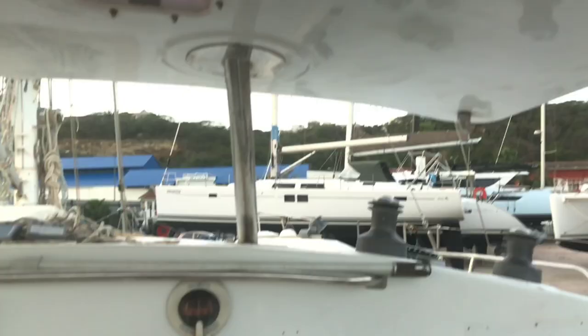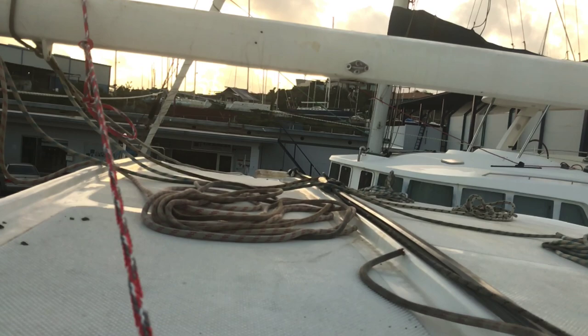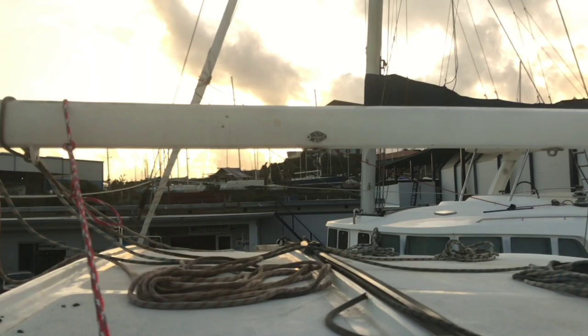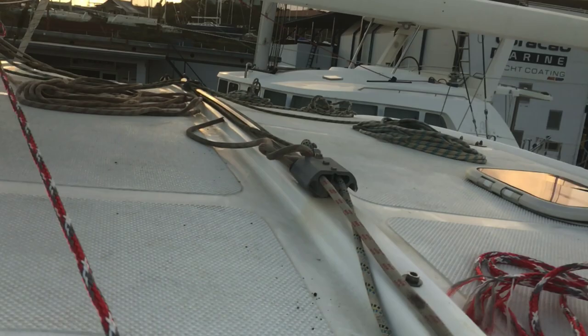Great bimini. They must have put a lot of thought into the bimini when they built this boat. You can stand on it. And, of course, the traveler system is up on top, which means a real short mainsheet block and tackle system. It was damaged, so I have to replace it. It was a 6-to-1, and I'll keep it with that. But I'm going to put a Dyneema strop through those fittings and then attach it to it. So I think it'll be a little bit stronger and a little bit more flexible, not so hard on fittings, etc.